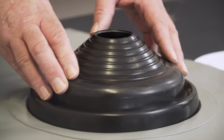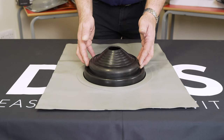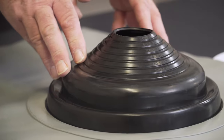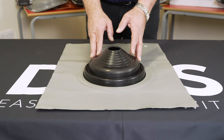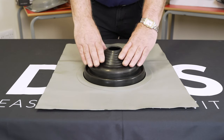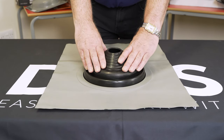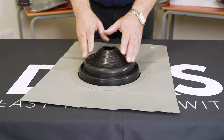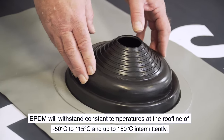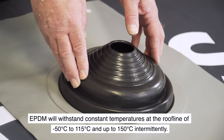This is a Saldeck New lead flashing for use on tiled roofs. It's for use predominantly sealing soil pipe, chimney, flue and vent pipes. It has a 0 to 40 degree pitch and it's an EPDM cone which has a temperature range up to 150 degrees centigrade.